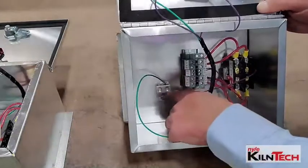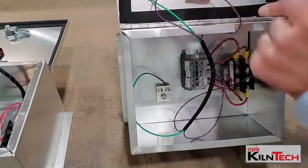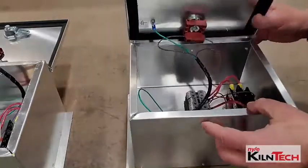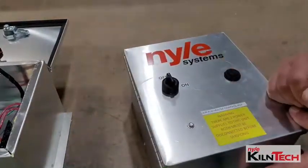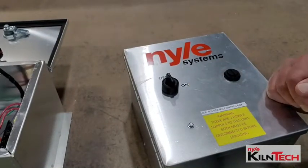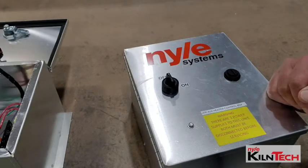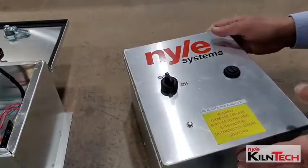Terminals 8 and 3 are in your L-200 where you will connect the signal wire to tell the heater to turn on and off. It's very important. There's a ground lug here for all your grounding and a ground wire mark here just for grounding the cover. On the box itself, you have off and on. When the unit is on, that means your L-200 or L-53 is controlling the heat. If it's off, it will not run.